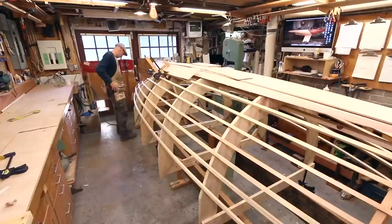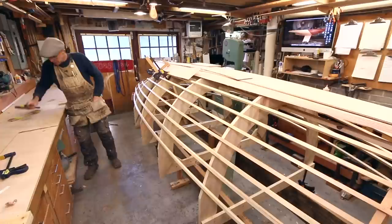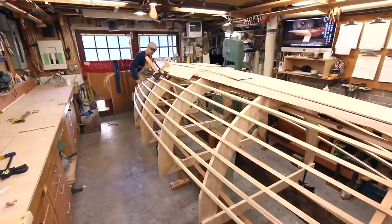I know what I'm going to do. Back here, I think, let's do this. I'll just pop a finishing nail in underneath the edge of the plank so that when we come back to deal with this a bit later, it's got something to bear against. I'll just mark where that pencil line is, or that nail is.